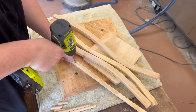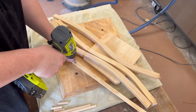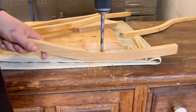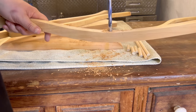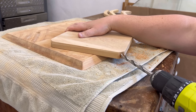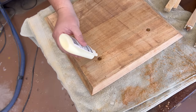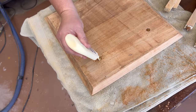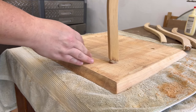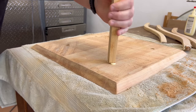On the other table I did pretty much the exact same thing — I drilled straight through the legs where the original nails were and then created a little pocket in the shelf as well. I added some wood glue and a tiny bit of sawdust into the holes to hold those original dowels nice and tightly on the top, and once I had them in place I hammered the new dowels through the legs and the shelf.